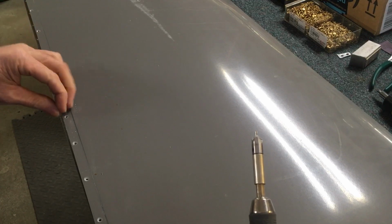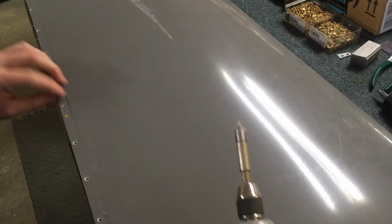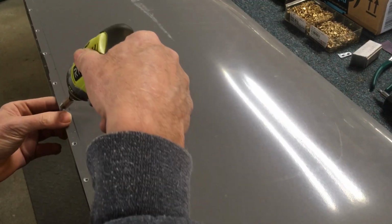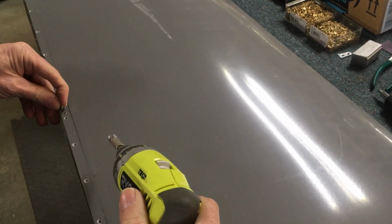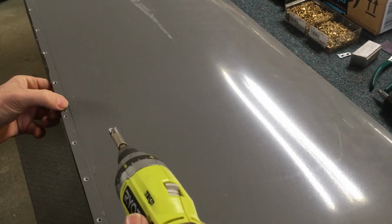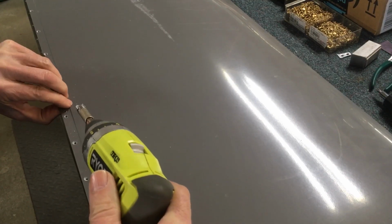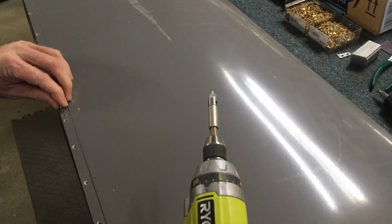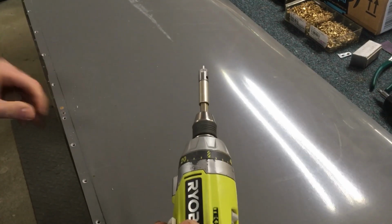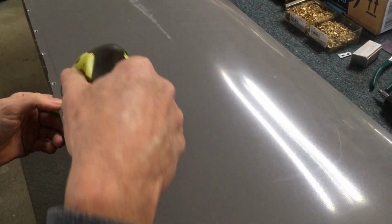Next tip is a soft rivet, and I don't have that one. That's pretty close. Move this rivet, check this one. I'm just checking to make sure that it's flush. I don't want to go much past flush. I want it just flush if I can get that. But you don't want it standing proud, because then it's going to hold this away from the underneath of the wing skin.